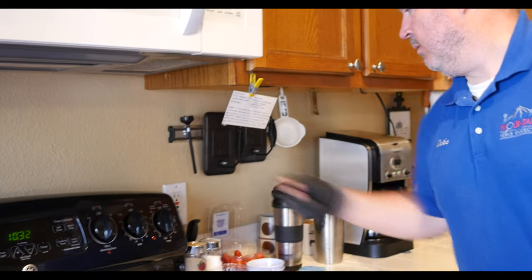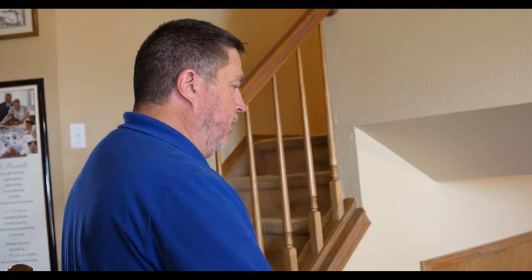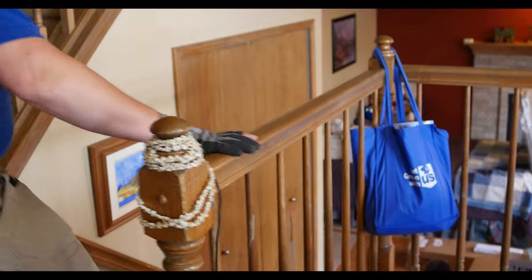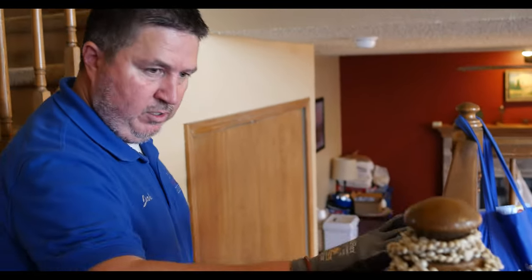We've got a floor outlet over here. This one's metal but you can see where these chairs have been dragged across it. Best practice would be to have one of the metal copper ones with covers on them, flushed down with the floor — that way furniture can slide over the top and it keeps debris from getting stuck down in there. It is a floor outlet in the kitchen area, so let's see if it's GFCI protected — sweet, it is. Make sure you reset any GFCIs you trip so you don't get a call back with somebody asking why their coffee maker isn't running.